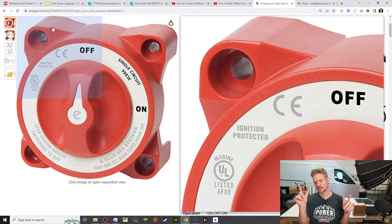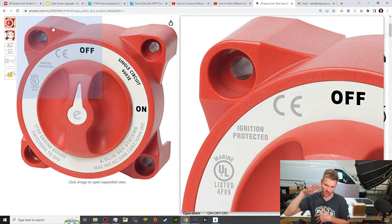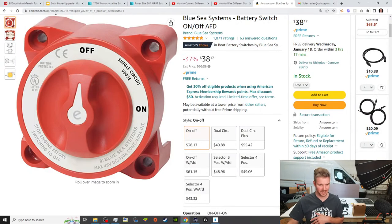because with solar panels they can have dead shorts within the panel themselves. So if you think about it, you have a dead short possibility with the panel. Then you have a dead short with the wiring. So depending on your current that you're pushing through the system and the gauge of the wire, it may be necessary to do an inline fuse. Excellent question, because guess what? This